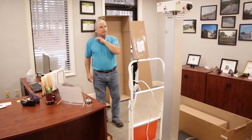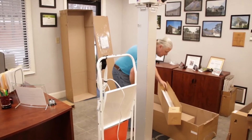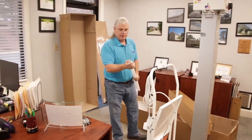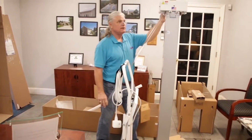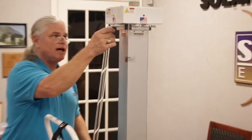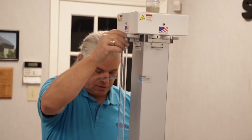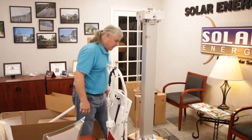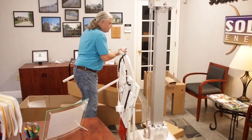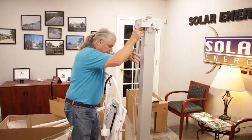The next step is to take the bulbs and put them in place. The bulbs will be shipped in a side box and will come out of their sleeves. Take care to try not to touch the glass with your hands. You're going to insert the bulbs into the pin socket receivers — there are tombstones. There's a little black piece inside each tombstone that allows you to twist the light and engage it, so you have to gently finesse it in place. We're going to go ahead and load up all the bulbs. It's a pretty simple process; you just have to be careful.